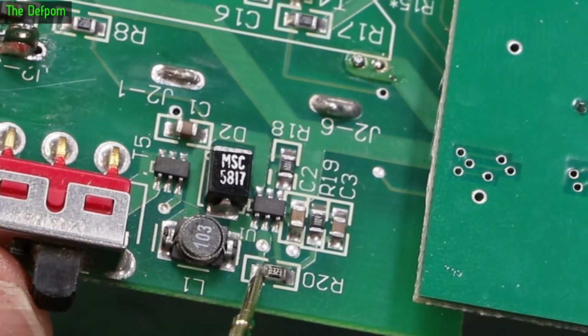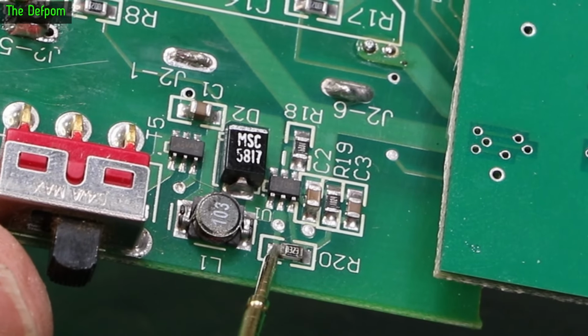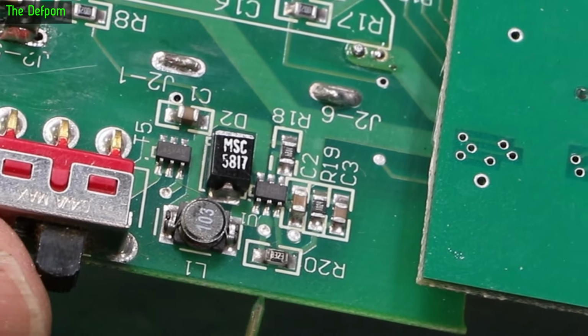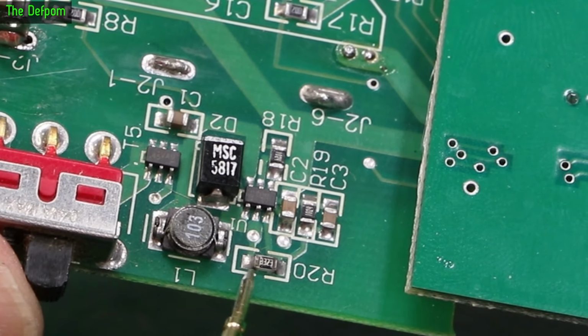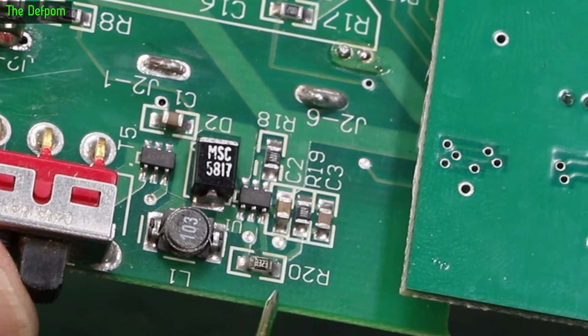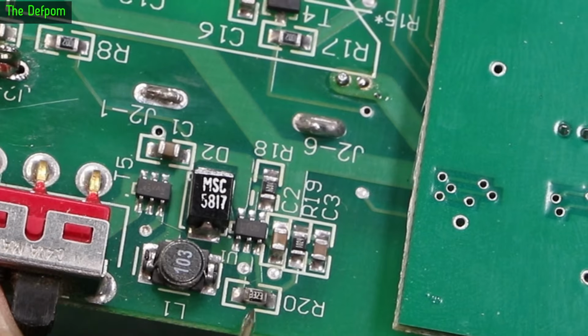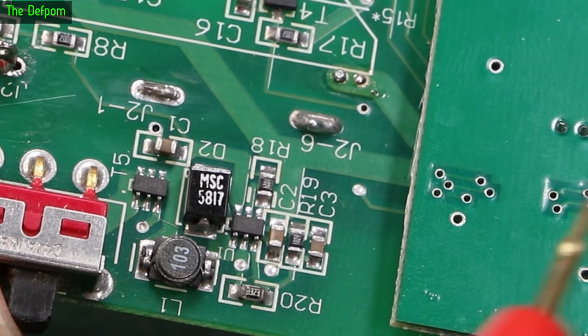And looks like a little bit of corrosion on there. Just on the edge, there's a tiny little bit. It's like a little bit crusty. It could be nothing, but it could be that it's slightly corroded and that's causing a shift in feedback to the switcher. It's possible. I want to look more closely at this under a microscope yet and see what's going on, but that's a 3323 marking.